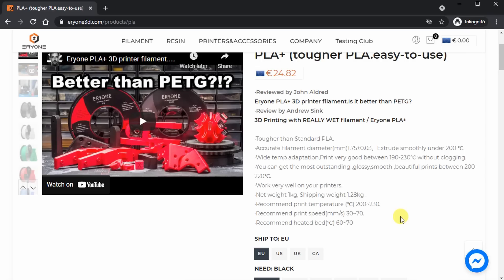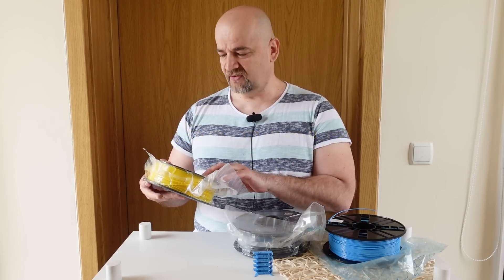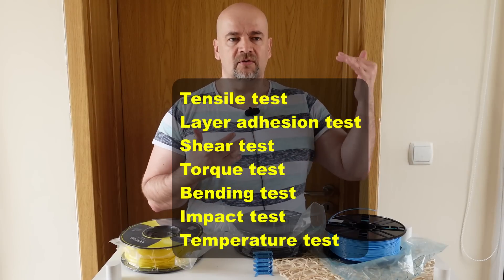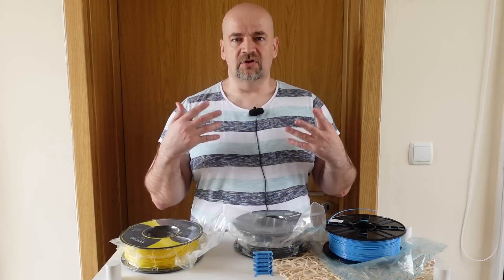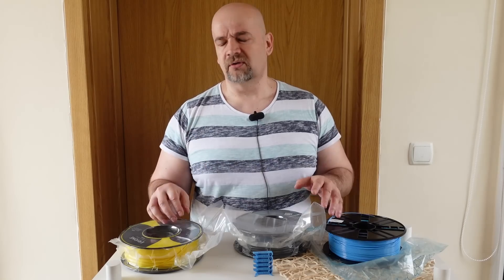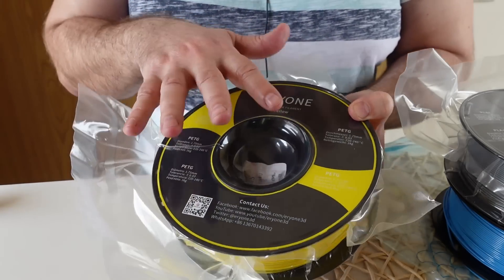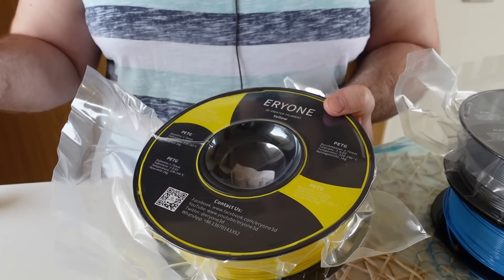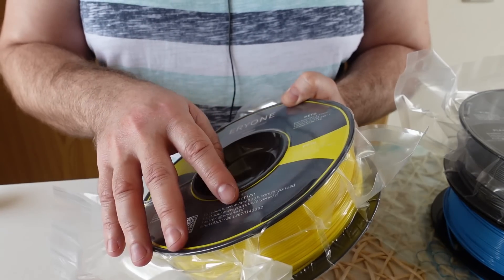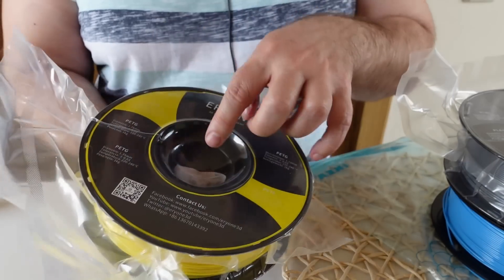And this is PETG — recommended printing temperature between 220 and 240 degrees Celsius, which sounds a little bit low to me. I usually print PETG at 250 degrees Celsius on my Prusa MK3S. What is important to mention about PETG is that it can absorb moisture from the air, so it is important that the filament is dry, otherwise we can have a little bit more stringing than usual. I will not dry it — I will do what most users do: take it out from the vacuum-sealed packaging, use it, and immediately afterwards place it back into sealed packaging with silica gel inside.